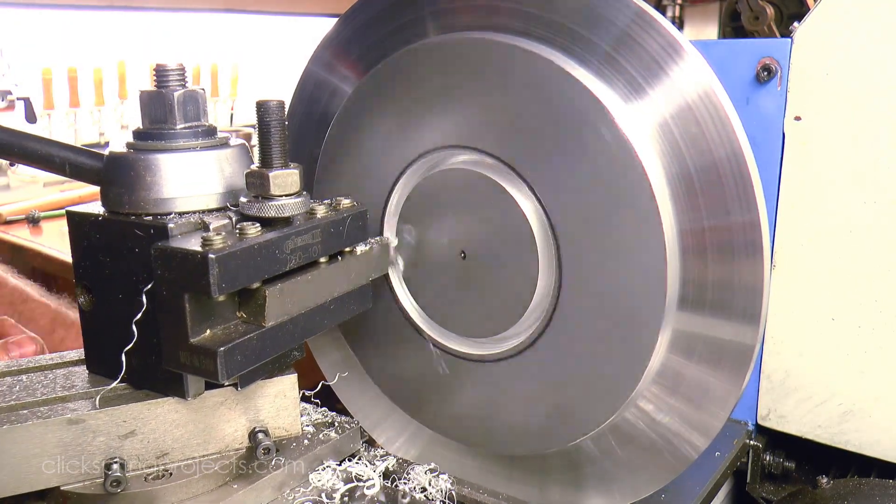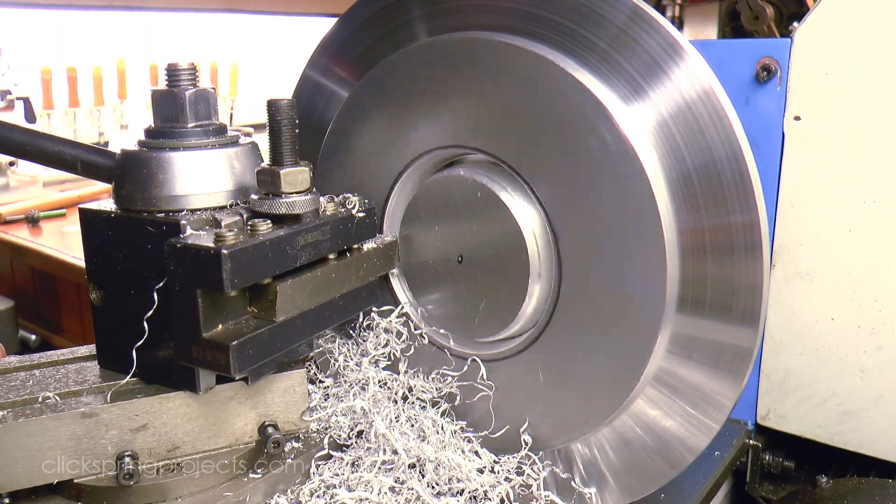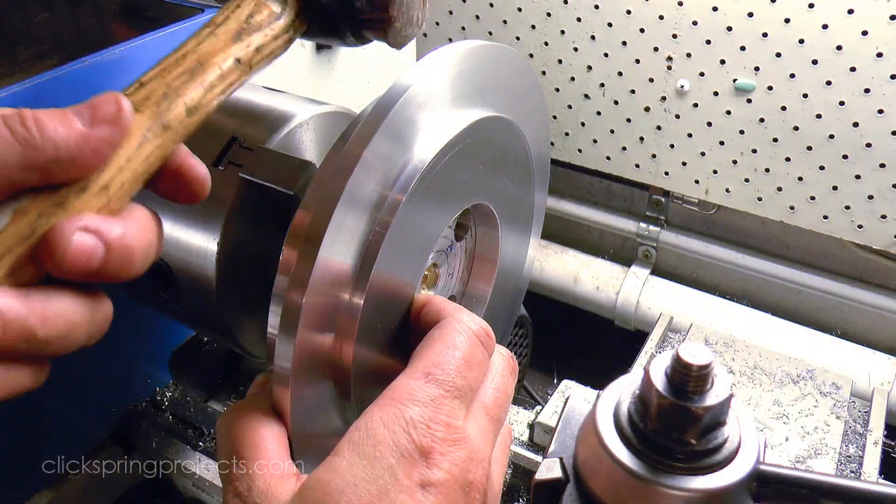All we need to do to have our system run the entire range of available flasks is to machine up a set of adapter plates for each flask diameter — in my case, from half inch aluminium plate.